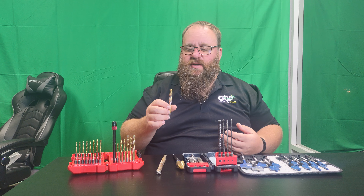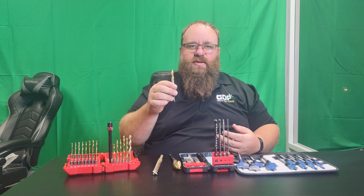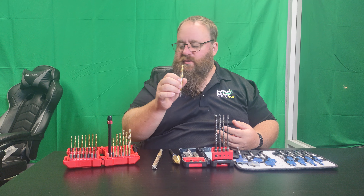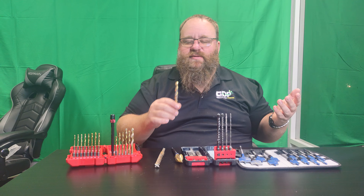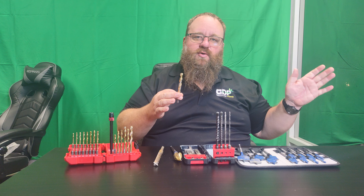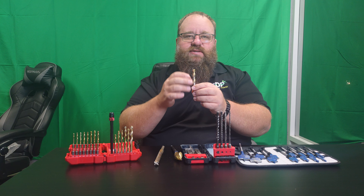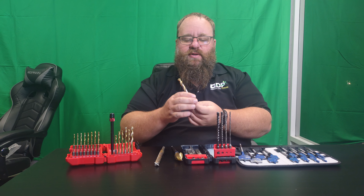There are a few different versions out there. You have your black coated bits, which are going to be your standard cheap bits you're going to get in the Ryobi kits, things like that. You usually get the titanium nitride coated bits — your standard for drilling, kind of your all-around bit. This will work for wood, it'll work for metal. It will not go into a block wall, stucco wall, things like that. So stay away from that. But for cutting your standard walls, this is the bit that's really going to work for you.